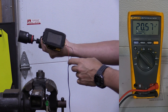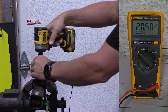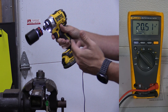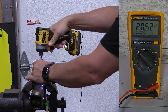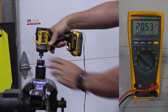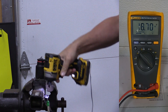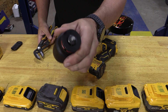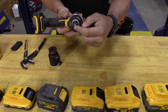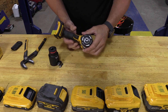Starting out with the Power Stack 1.7 amp hour battery — this is the tiny one. We're showing 20.57 volts at rest, 20.58. It only dropped into the 19s, which is not bad at all. When we looked at the Milwaukee stubby, that would drop two-plus volts. We are in reverse, on level three. Unfortunately the bit broke pretty easily, but it stuck out so it came right out — no big deal, we can find something else and try again.